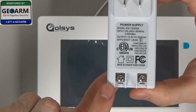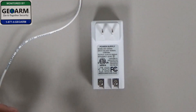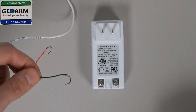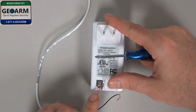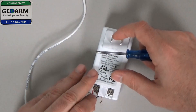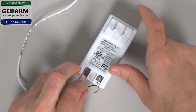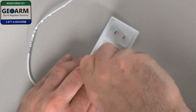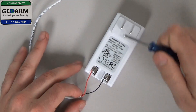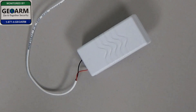Now we're going to go ahead and wire the transformer end. Just to show you some quick information, you'll see that on the left of the screw we have each screw — there's a positive and a negative. Make sure you locate that and know where they are, so you can work with the polarity. Now you see we have the 22 gauge wire, the opposite end, and we have the transformer. You'll notice on the left side it says plus, on the right side it says minus. So we're going to take our red wire and make that go around the positive side, and go ahead and screw that in — not too tight. Now we'll take the negative end, hook that around the end, and screw it in as well. Give it a nice little tug. Verify that you have the red with the plus, and the black with the minus, which is the negative. And that's how you wire your transformer to your Qolsys IQ panel.